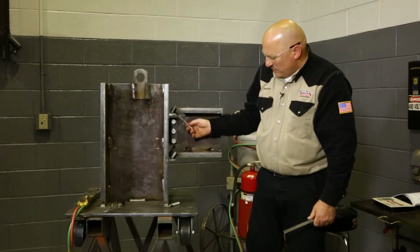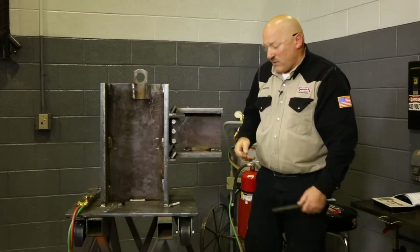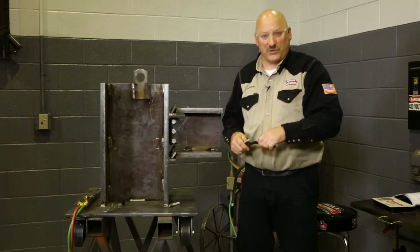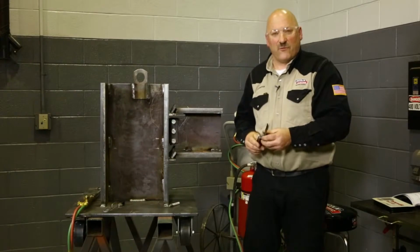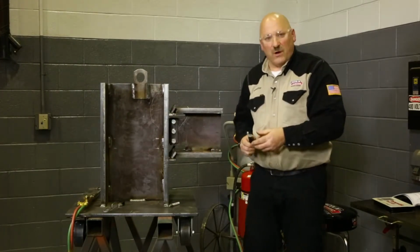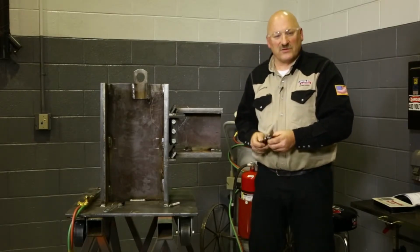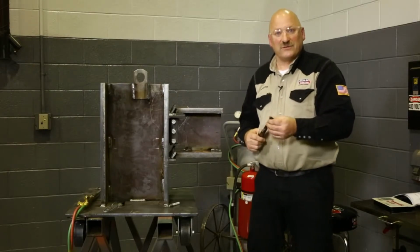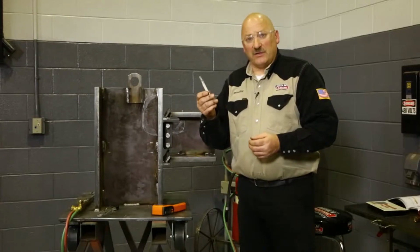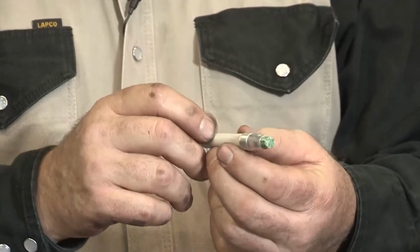And the vertical weld, if this is welded around on this shear plate here, would be welded with a 71 T8 wire, like an Innershield 232 or 233. Usually a 5/64 or 0.072 diameter would be used on that weld. It could also be stick welded and welded with other processes, but that's typically what's done on a big project. It's a self-shielded flux core, and it is low hydrogen too. There's a number of ways to measure the preheat. Temp stick is the most commonly used in industry because they're portable and they're actually very accurate.